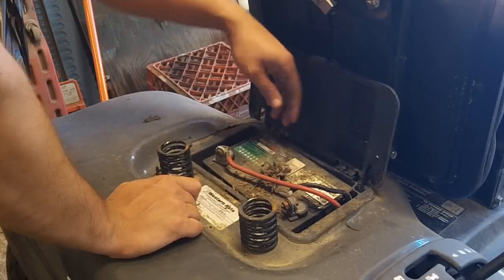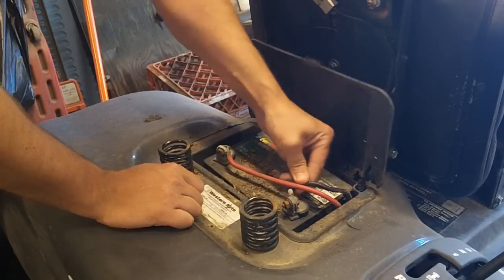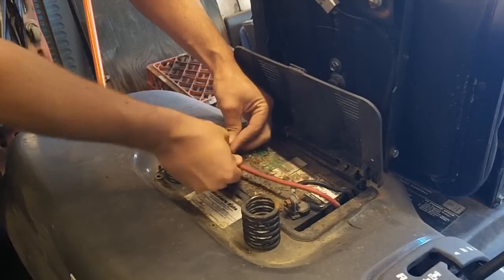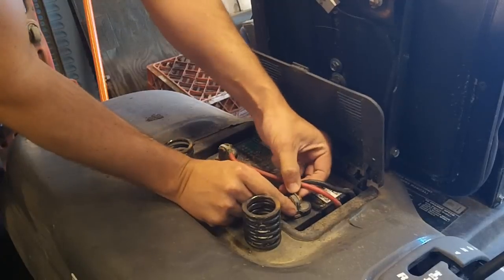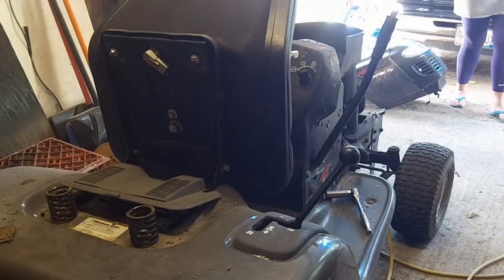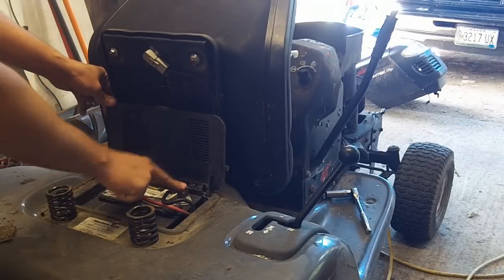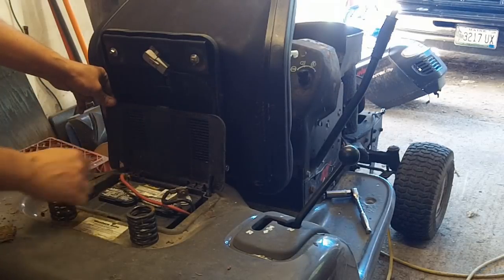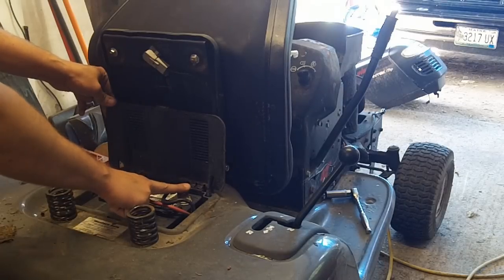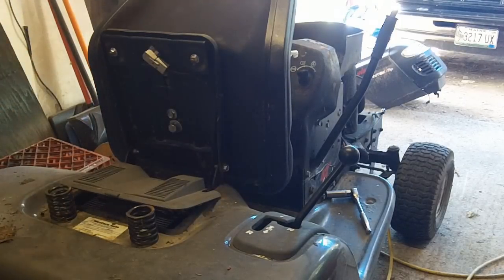So I was trying to figure out why the electrical didn't seem to be working right, and sometimes you should just check the basics. In this case — I don't know if you can see that — but the battery wires are entirely loose. So we're going to pull these off, clean them up, check the battery for its actual voltage, and go from there. Just a side note: on these vented boxes, the tabs coming out of the battery are supposed to be on the upper part. Craftsman uses a battery where you've got the plus on one side and minus on the other, and the battery that was in here was inverted. So now we're all tightened up — let's see if it'll actually turn the motor over.